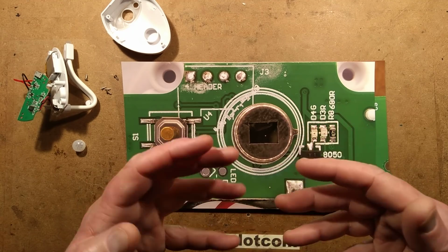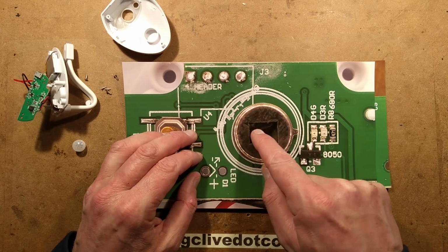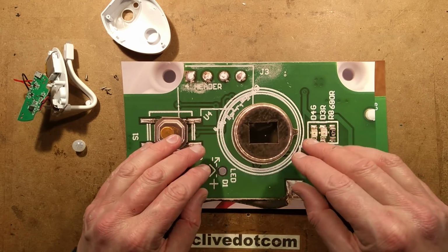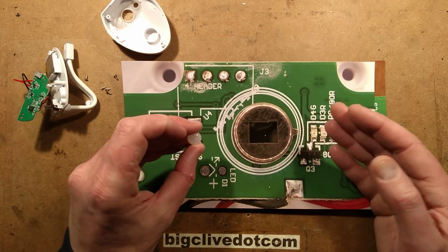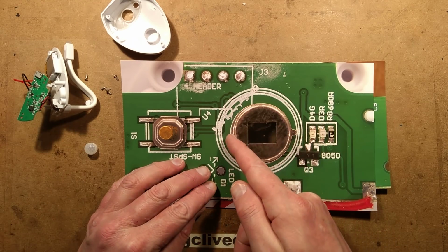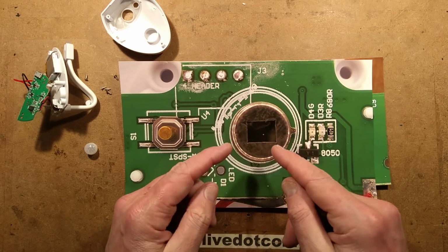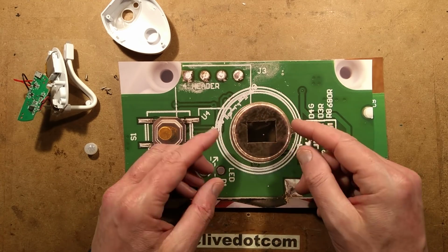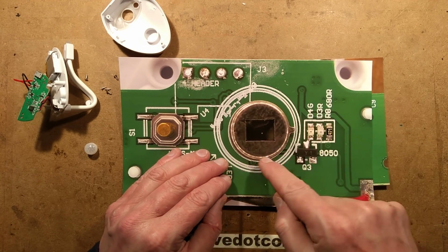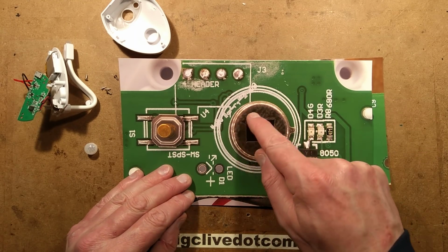So the ambient infrared heat, the ambient room emission, stimulates both the positive and the negative ones. They're configured back to back to do that. But when you get a point source of heat moving about in front of these lenses, it creates a pattern, a sort of spike of heat that passes over. And when it does that, it causes a push-pull effect, and that then drives a MOSFET in here, well, a FET, a field effect transistor, very sensitive transistor, that then creates a fluctuating voltage when it detects movement in the room. Very simple in a way, but actually really complex.